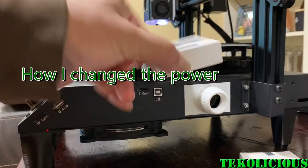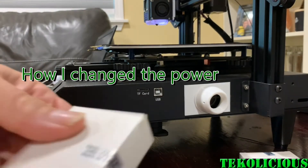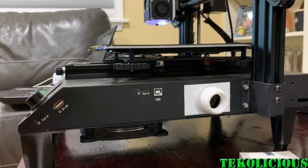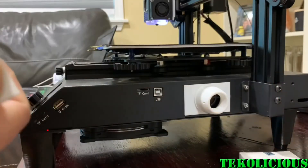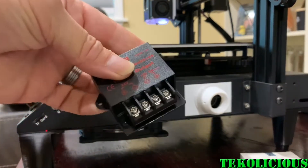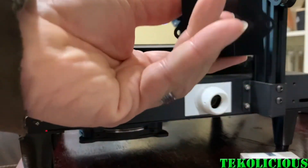So I'm going to have to deal with this box that has my power supply that's going to convert it from 24 to 12 volts, because these fans are PC fans and PC fans are 12 volts, not 24 volts. This box is pretty good size, looks pretty stout, kind of well built, and it's heavy.